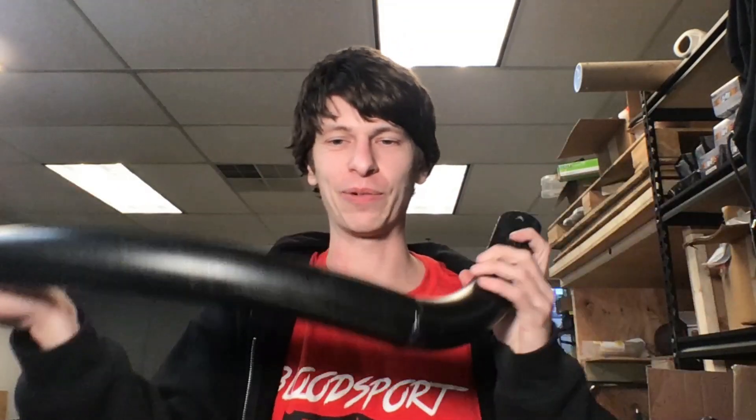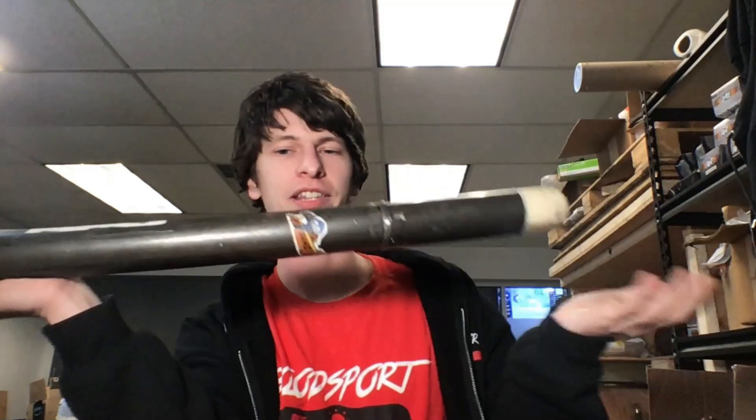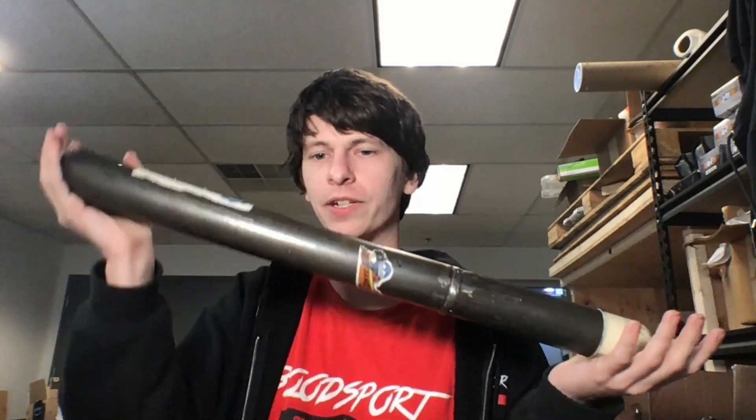The second big concept we were working on is the self-righting pole. Here we have our self-righting pole — what's going on here is this curved shape, right? Why is it curved? To explain this, I also have a Gigabyte pole with me. How does this work? You have the chassis here, the ground here, so as this thing hits the ground, it's applying a big torque — it's basically a big lever applying a giant torque. As it goes up, the torque lessens and it topples itself back over. But at the very beginning, there's a huge torque requirement.